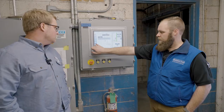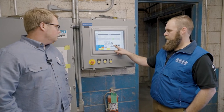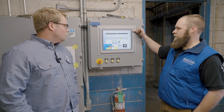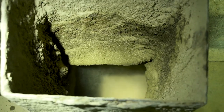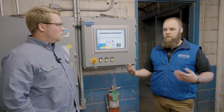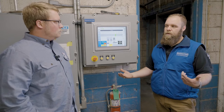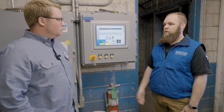From the unloading system, we've got three different bays — we can unload from truck or two rails. The ingredients go into the basement, get conveyed to the top using an elevator, and then distributed between these 36 different bins we have. These bins can vary in size based on the ingredient — something like rice is very fluffy with low density and takes up a lot of room, where calcium is dense and takes up less.